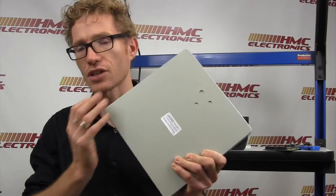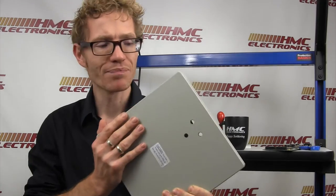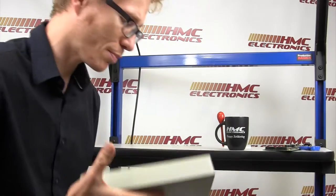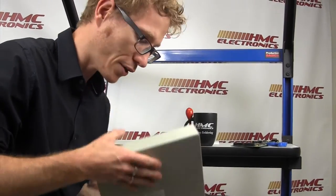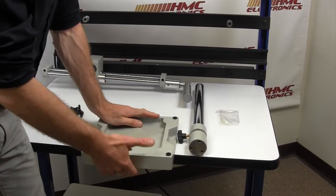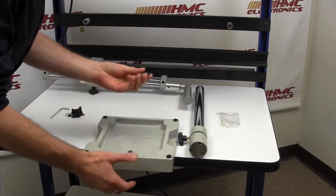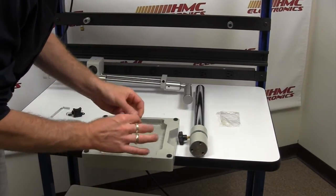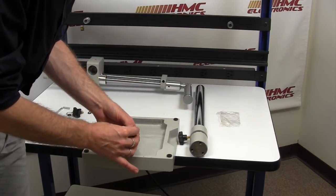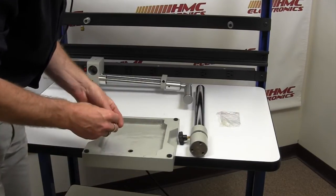Just as with the single arm boom stand, construction of the dual arm starts with a very heavy base plate. When you're assembling your vertical post, hang over about one-third of the heavy base plate. Not too much though, or it drops on your foot. Hang over one-third of the base plate, take your three set screws, drop those in with the washers, and then screw on the vertical post. You're going to find this to be the easiest way to assemble the post.